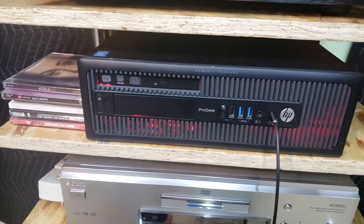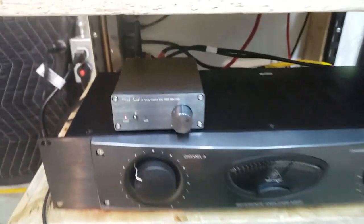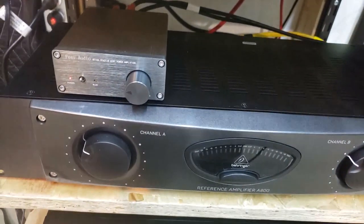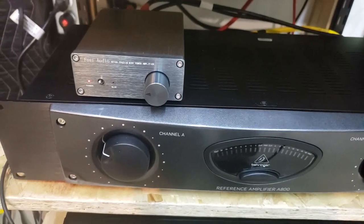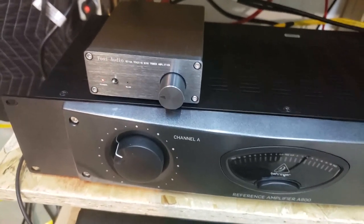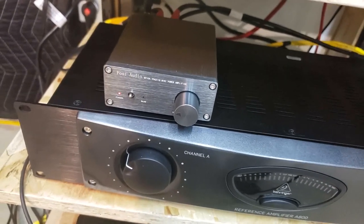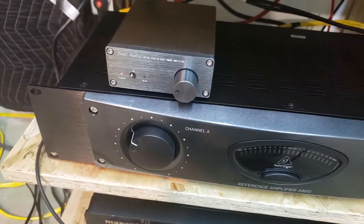At about three quarters of the way up, when I first started to hook this up and started playing it, no music would come out of it. I forgot — if your Bluetooth is on on your phone, even if you've got other stuff hooked to the RCAs on the back, no sound will come out. Bluetooth has got to be disconnected from this device. Because if your phone or pad is within range and Bluetooth is on and set to connect, you won't get any audio out the back. You can't separately turn the Bluetooth off — you have to turn it off on your device.